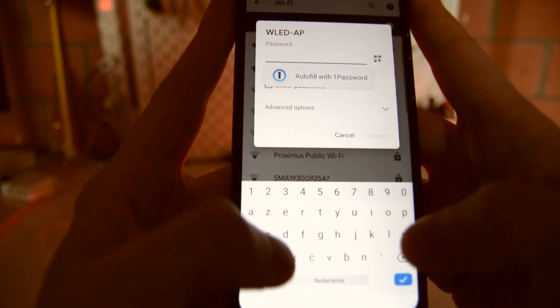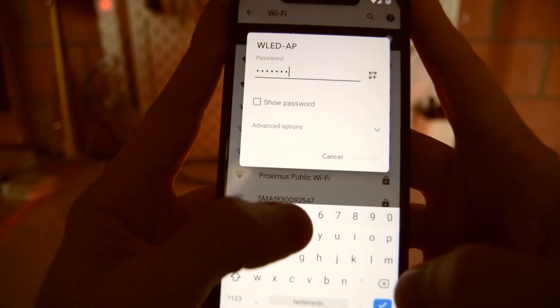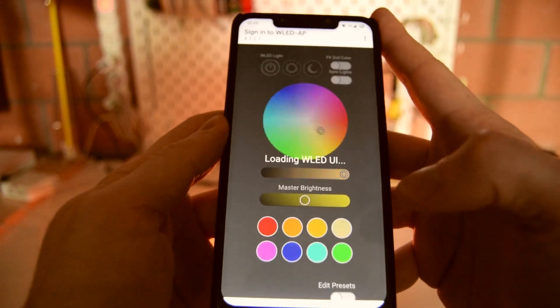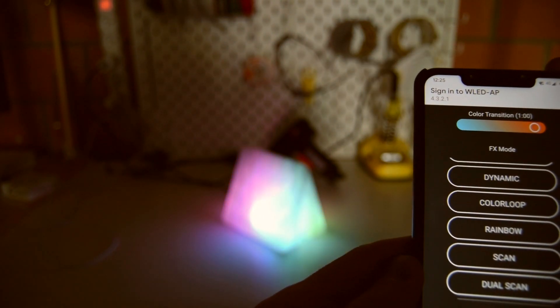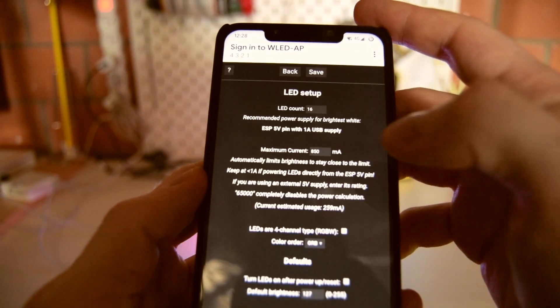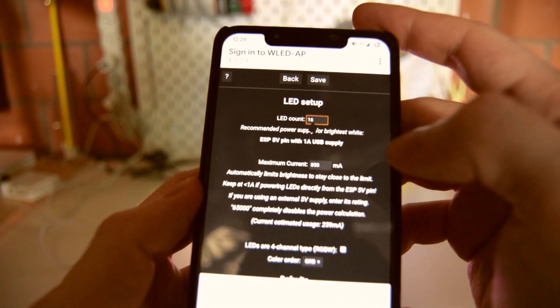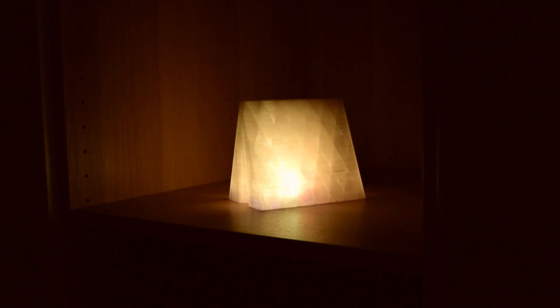Finally, you can plug it in again and use a Wi-Fi device to look for the signal the WeMos is broadcasting. You can connect to it with the password wled1234. If you're lucky your device will show you the way to the web page to control the light. There you can go through all the various colors and effects, or go to the Wi-Fi options to connect it to your network. One important setting to pay attention to is the number of LEDs, which in my case is 16. And then you're pretty much done — you have a little smart light you can program or control from your smartphone, and hopefully some very happy kids as well. Good luck and see you next time!